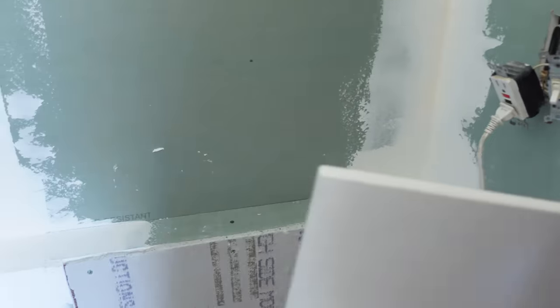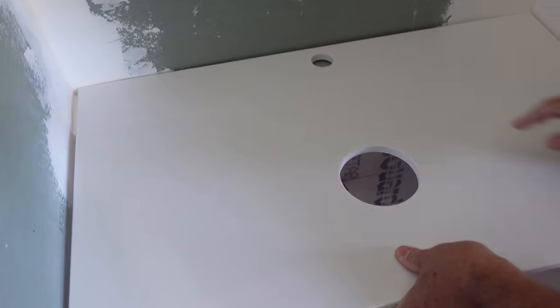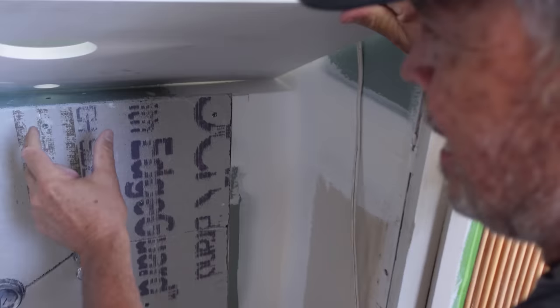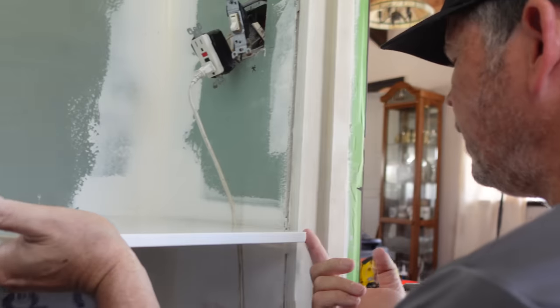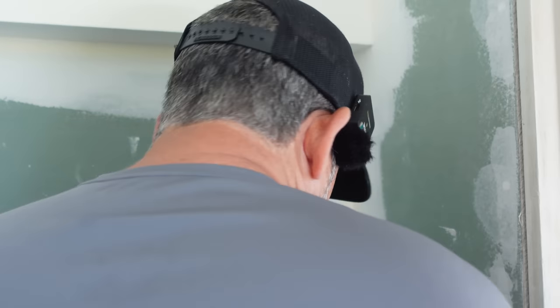Now let's give this thing a test fit — we were really anxious about how we're going to get this vanity in here. It sits on the ledge all the way back. I've got a drywall screw right in the way — that's where our faucet is, so I'm going to put a big notch there, and I'm also going to have to notch in the back because the faucet is going to be in that wall and the hoses are going to come out and tie in. We got it back as far as we could — we're sticking out past the door stop by about an inch, but that's the best we can do. It was way out here before, so that worked for three inches.